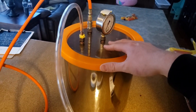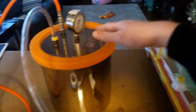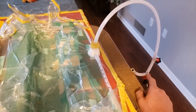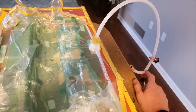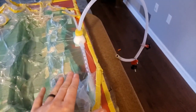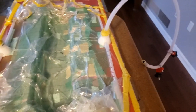Then once that is done, I'm going to take the epoxy out, set it to the side, pull the whole part back down again. Once it is all down, I am going to put the infusion tube into the epoxy, and then I will crack open the infusion line and start leaking the epoxy in. Once the epoxy is flooded all the way through, which we will control, we want a very slow migration. I want to use as much of the gel time as possible.